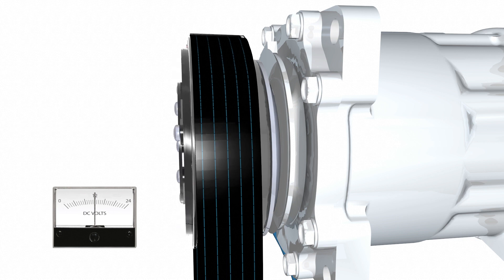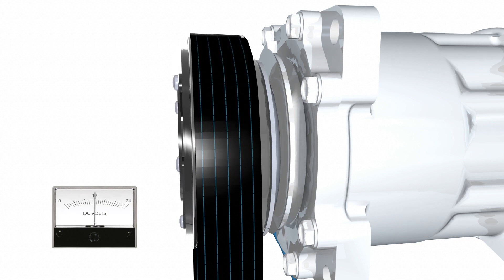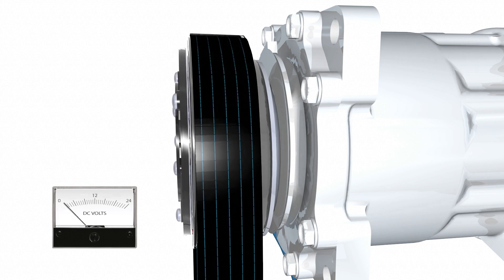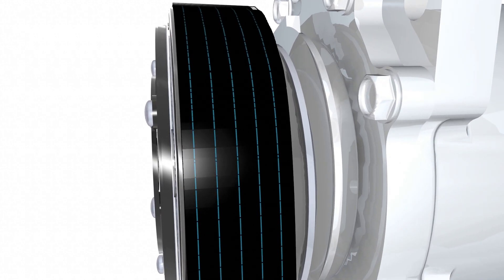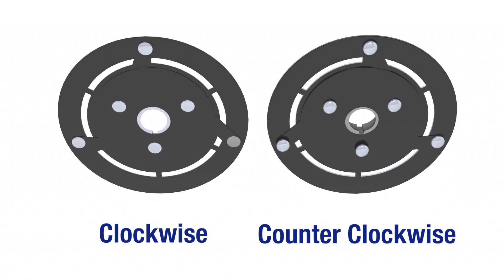The magnetized rotor and armature attract each other. The clutch momentarily slips on initial engagement. The torque is transmitted from the pulley rotor through the leaf springs and into the armature hub, driving the shaft of whatever is attached to the hub. When the clutch is fully engaged, there is no slippage and the torque transfer is 100% efficient. Although some clutches use bidirectional dampened armatures, most mobile clutches use leaf springs to transmit torque. The springs need to run in tension, not compression, so clutches are either built to run clockwise or counterclockwise.